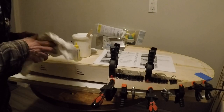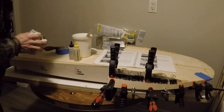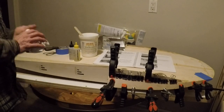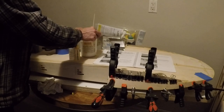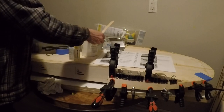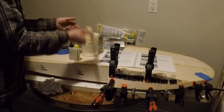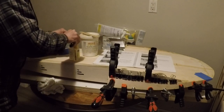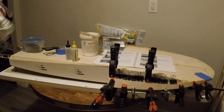That's our second forward non-trip installed in our boat. We were very accurate on our epoxy mix and had a decent amount of filler in it. While we're talking about colloidal silica — it is a fiberglass powder — be very cautious using this material. Do not breathe it in or consume it in any way; be very careful using it. I just dabbed a little bit on a craft stick lightly into my cup, kept mixing until I had a really good consistency, and then applied it to my parts.